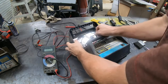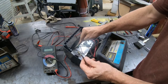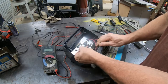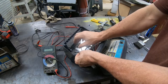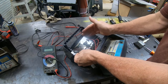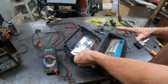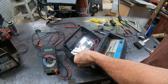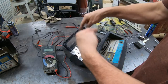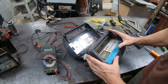The amp gauge will still work. I haven't fully tested whether you could leave the board in here, screw a blade terminal to this plate, and just plug it in — I'm not clear on what the board would be doing in the background. You can experiment with that if you want, but in this conversion we're taking the board out and chunking it, because I'm never using this as a battery charger. We've got one of the big box ones on wheels for the farm — this is going to be for electrolysis.